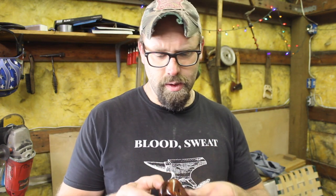That stinks. Okay, well, I feel like an idiot because I had inch and an eighth Corby bolts right here that if I would have used those in the first place, we would have been golden. Everything would have been perfect. Yeah, I'm going to scrap these and I'm going to make another set because I do want to have plenty of material left on the handle scale that the shoulder of this bolt's going to grab onto. I mean, I could put these on, and this one is getting really thin right here. I can't really just remake the one because they're matched together. So I'm just going to throw these away.